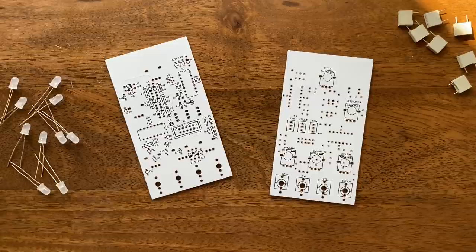The idea with PCBs is that you create a layout for your circuit in a software tool, where you can place components freely and draw copper traces to wire them up. Then you send your design files to a PCB manufacturer to get them produced. This gives you a lot more flexibility and allows for way more efficient and compact layouts than what would be